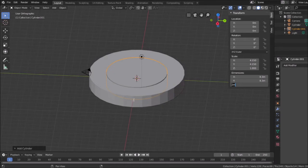This red line that's intersecting right through the x-axis, if it's 1.8 millimeters total height, it's actually 0.9 millimeters high from the axis to its top edge, and the same from its axis to its bottom edge for the overall 1.8 millimeters. So if I want something to stick up an additional two millimeters from the top here, I have to get a number that makes this the same. So we're talking 1.8 is there, plus two more millimeters. I need it to be 5.8 millimeters. That's more like it.